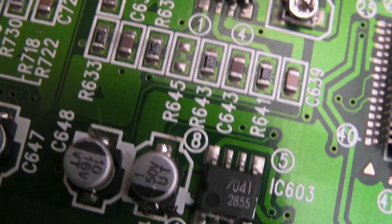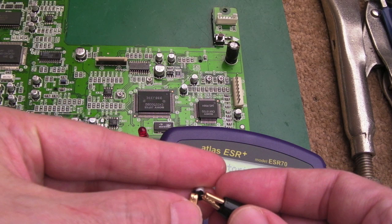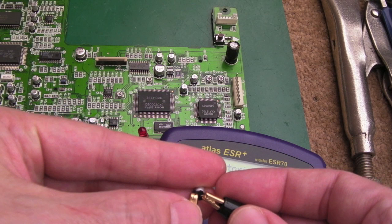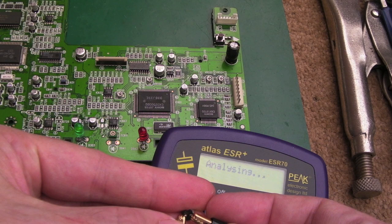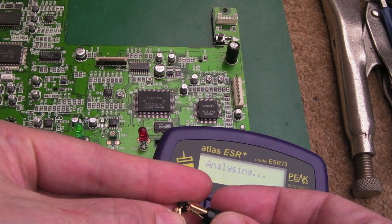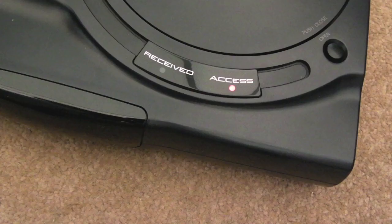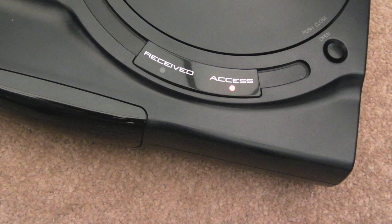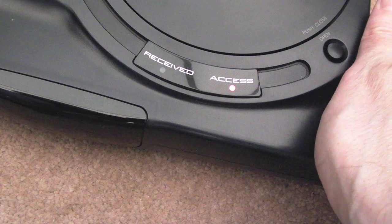It's starting to look a lot better now. There are still little bits around here that need cleaning. I measured a cap and got 7.2 ohms — so either that's one of the original caps or it needs a recap. I'm going to suggest we order a recap kit for this. Doing a quick bit of testing — let me show you what I've discovered. Can you hear? There's no CD audio music. And it's only coming through one channel, which is something I didn't really notice at the start.